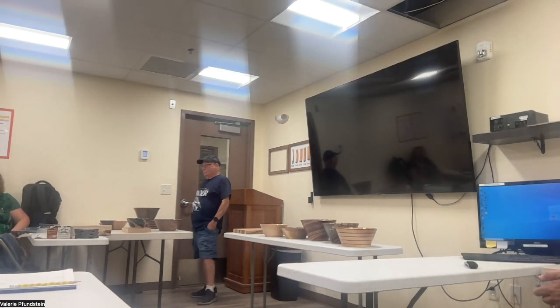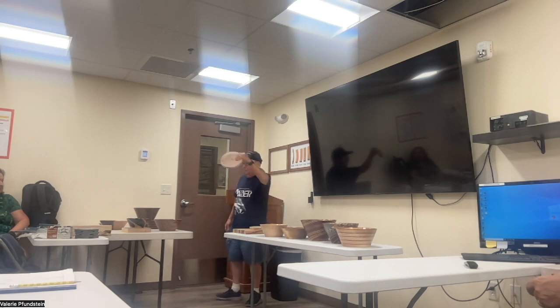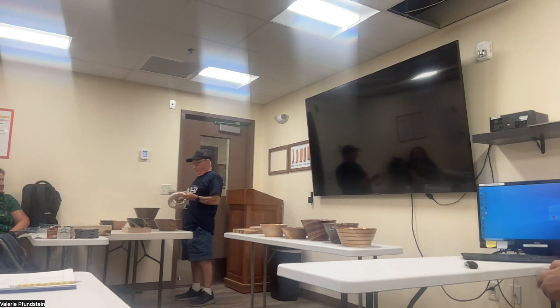It's interesting. That's like with this Ringmaster, I do the class, and at the end of the class, you have this. And I tell you, if at all possible, get that glued up by tomorrow, because if you wait 3 or 4 days, these will no longer be round. They'll be oval. Then you've got a mess.